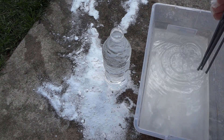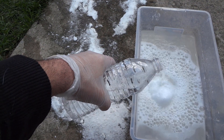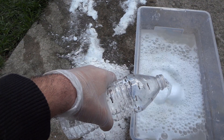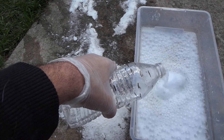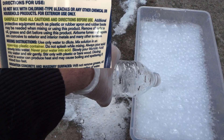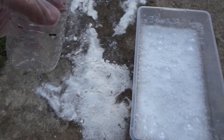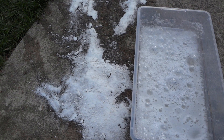To dispose of this acid solution, I'm just going to pour it into my neutralization solution. The acid and bases cancel each other out rather quickly in the form of bubbles and heat. You really should pour the neutralizing solution into the acid to avoid the acid splashing onto you, but I couldn't do that with my container — just something to consider if you're attempting this process yourself.